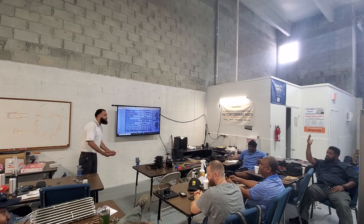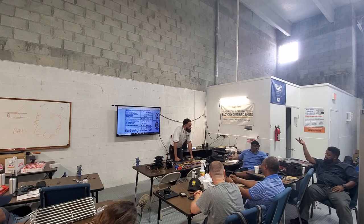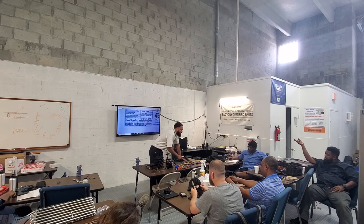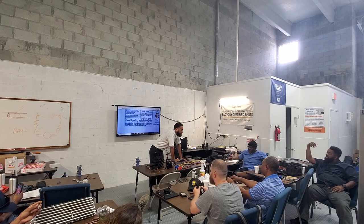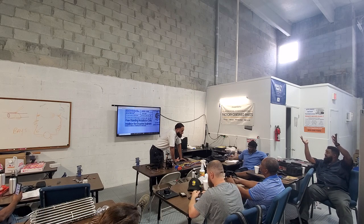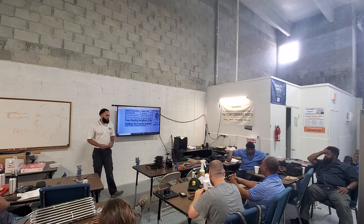We still have nitrogen in the system. We checked for leaks. We checked twice. We filled it up with 103 PSI and we ain't seen no bubble. At this point, we're checking to make sure we don't have any leaks under temperature and pressure, making sure they aren't fluctuating. You might notice about 5 minutes. Then after that, you release the nitrogen.